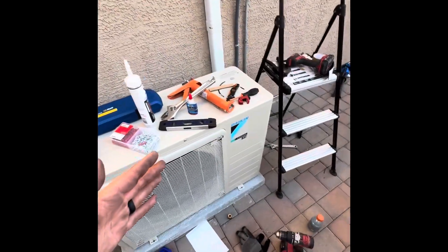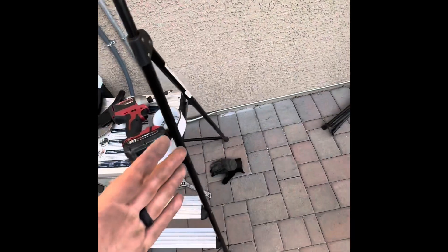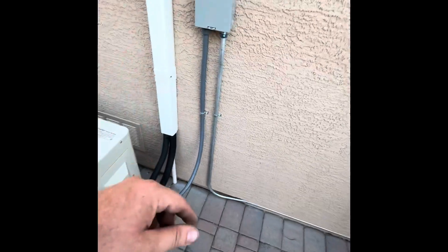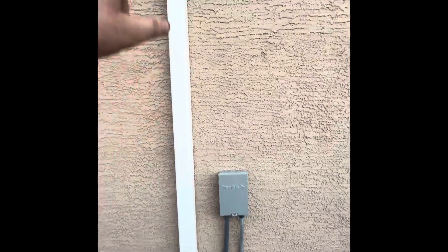Do I get Mama Sarah's approval? Look at how nice this is — awesome. Line come up the wall, all hid away right here. Beautiful conduit. Tucked underneath the house. Through the wall, tight up in here, with matching breaker. You won't need to touch a breaker like that. Lock the breaker panel back up. Conduit, electrical — all ran. Underneath this wall right here, down through there, under the drip edge, come over here. Bend the conduit to come around, offset, keep against the wall. Two-pole disconnect, fused. Line set hideaway. R32 Daikin mini split. Line set cover goes all the way up, sealed in the hole up there.